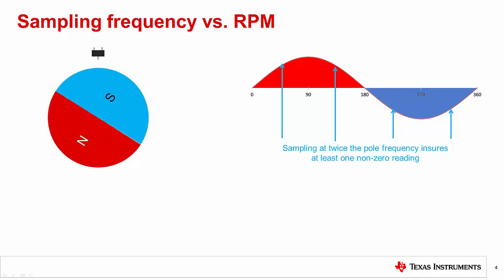Please note that when the sampling rate is two times the number of poles per second, most of the samples will measure a magnetic field that is significantly lower than the peak value, since the peaks only occur when the sensor and pole are perfectly aligned. In this case, a stronger magnetic field than the maximum operating point of the latch should be used.